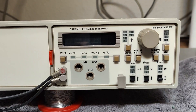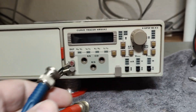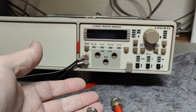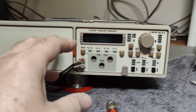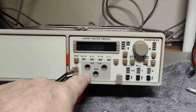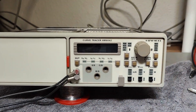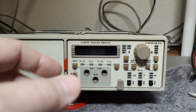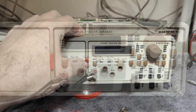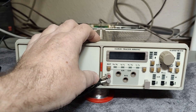I'm quite excited about this because I think you need to connect these two to an oscilloscope in XY mode, and then it will display the sweep on your oscilloscope. You can connect different components — it can be transistors, all sorts of funny components — and it will curve trace and sweep them. But let's try and see what is going on. Nothing is going on.